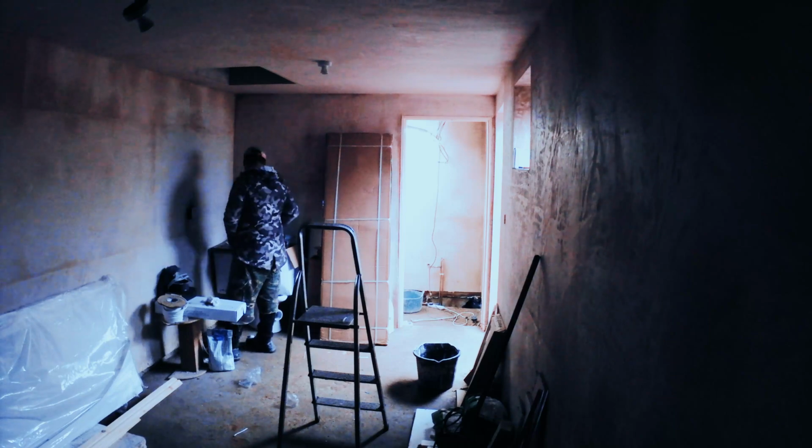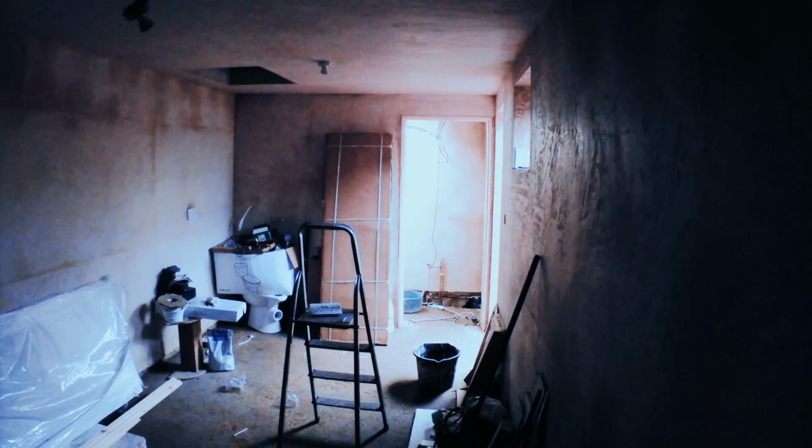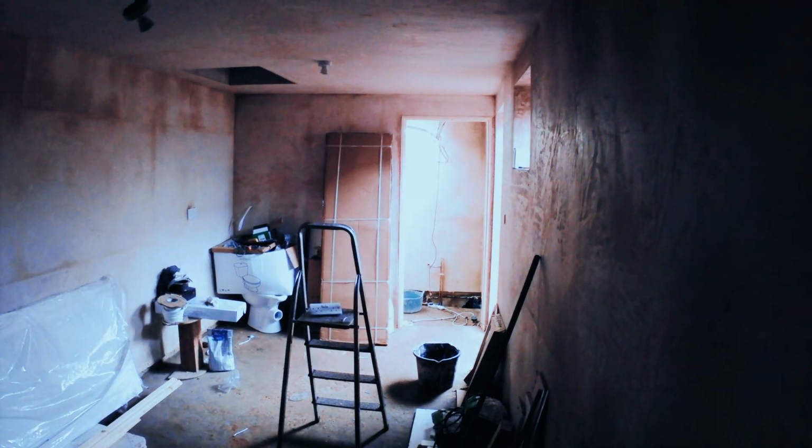And I think it worked out in my favor, because that cable was in the wall. So if I need to access that in the future, it might have been a bit more tricky, because I would have to break the plaster. So what he ended up doing was putting another cable in, and we're going to have a plastic casing on the wall. And that's good for me, because I'm thinking there's 2 light switches here, and I may decide to partition this room into 2 sections, so then I can have a double switch, which may be something in future.